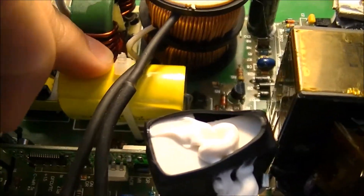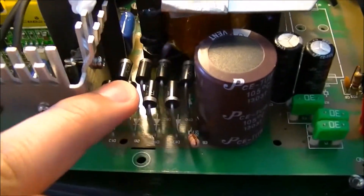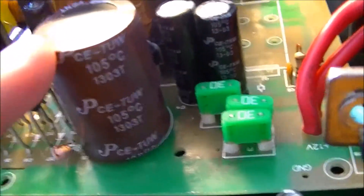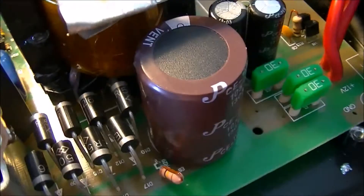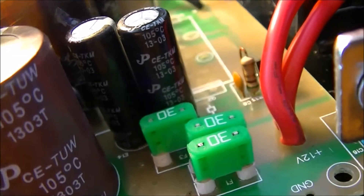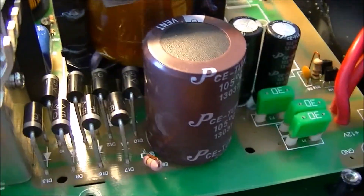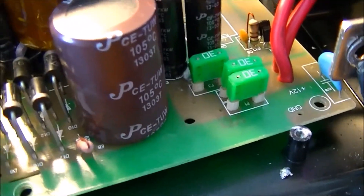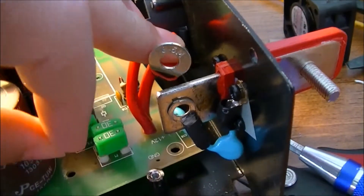There's a big filter capacitor alongside the chokes, and those look like resistors in there. There's also your diode. The output capacitor is 250V, 470 microfarad. The input caps are 25V — worth mentioning. Also, I noticed they actually added two lock washers on the positive cable bolt.